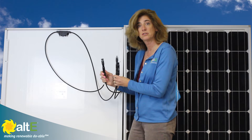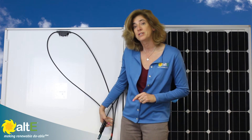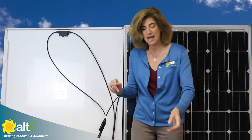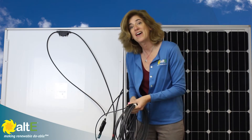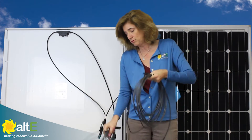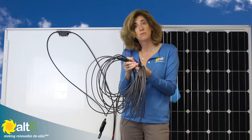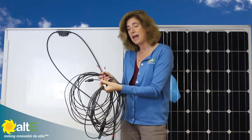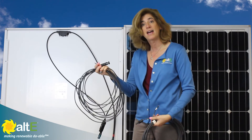Now I end up with these solar connectors at the end — so what do I do with them? I'm going to get an extension cable that will go the distance between here and the breaker. Whether I'm going into a DC load center or a charge controller that's got a breaker built in, you need to know the distance you're going. You would get an extension cable that is two times longer than the distance you need, because you're going to cut it in two — that will give you one cable for your negative and one cable for your positive. You'll end up with a female on one end and cut-and-stripped on the other, and a male on one end and cut-and-stripped on the other.